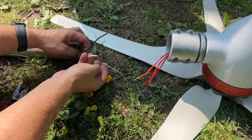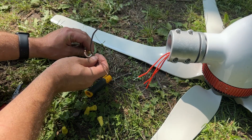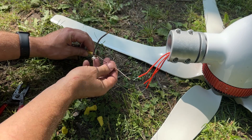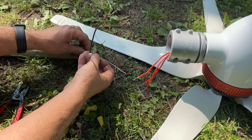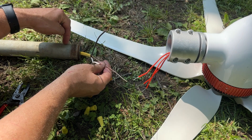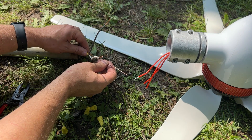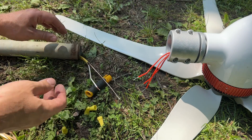My original plan was to just use this as three conductor, but I failed to realize this one doesn't have sheathing on it, so it's going to touch the side of this pipe and it's going to ground out. So we can't use this. So what I'm going to do is something really cool. Whenever you say that, it's not cool.